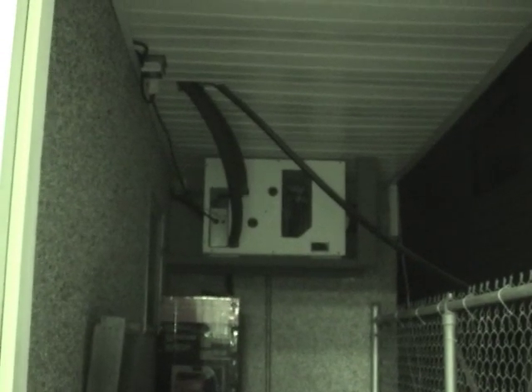Here's the pretty much finalized installation of the heat pump. I've got it installed on foam rubber pads to dampen vibration. I've also temporarily got a power meter installed up here, and so far over four days it's measured about 8 kWh per day, which is about 50 cents a day. That's quite a bit cheaper than about 90 cents a day that the gas water tank would cost at current gas rates, and the savings will be even better when you consider that gas rates will go up once the economy turns around.